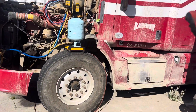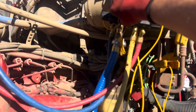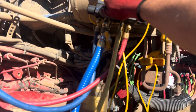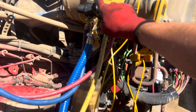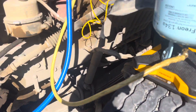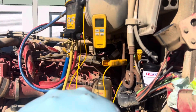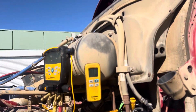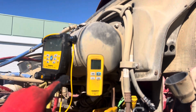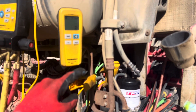All right, let's fill this up — three pounds six ounces. It's not four pounds six ounces; if it had a sleeper cap that would be the case, but that has been removed. Our low side is closed, our vacuum is closed. Let's disconnect our vacuum. Vacuum is disconnected, we are zeroed out, and we want three pounds — three pounds six ounces. High side is open into the liquid line; it'll be going into the receiver.